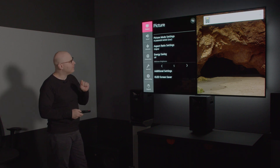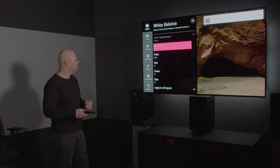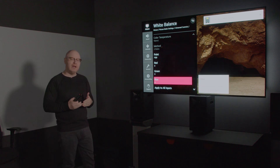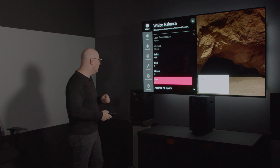Josh is seeing a slightly different yellow tone between the two images looking at the rocks. Since he's seeing it across the image and it doesn't appear to be a saturation issue, I'm going to look at the white point and offer a slight shift. The Sony's looking a little more yellow than the LG. So to add more yellow on the LG CX, I'll go into settings, advanced controls, white balance, and adjust the high point — the gain control. To add more yellow, I'm going to subtract blue. Think about a CIE chart: yellow sits between red and green, so subtracting blue moves the color point toward yellow. I don't like to push the gain above one to avoid clipping a color channel. Let's take out three clicks.